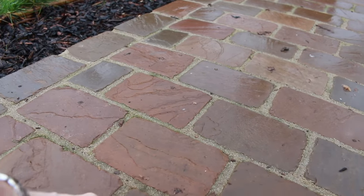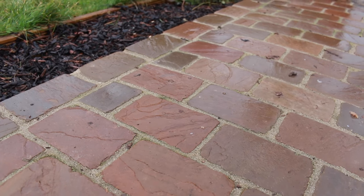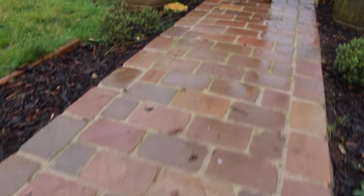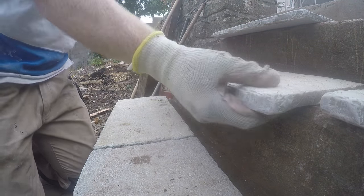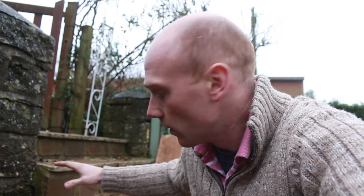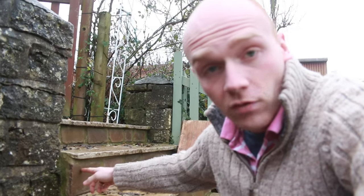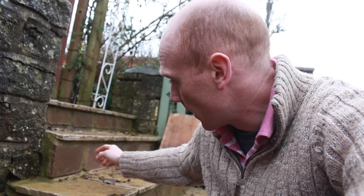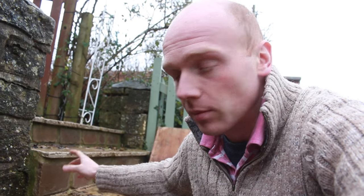It's been down about five months and the pointing is holding up really well — it has gone slightly green and mossy over the winter but I'm pretty sure it'll scrub up in the spring. The main thing I hadn't shown is how we did the steps. These were just concrete steps before with render on them, but we used the same limestone paving stones as on the patio. We had some leftover and we've done all the treads in that, and on the risers we've used the sandstone sets from the path. There's a bit of staining on the sandstone as it stains a lot easier with cement.